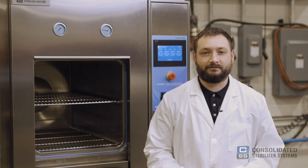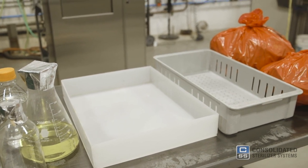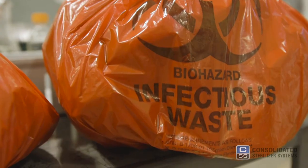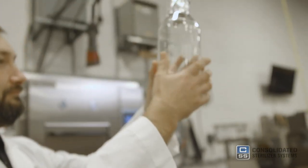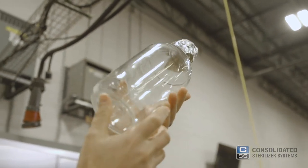In order to prevent damage to the autoclave, it's important that you only load autoclave-safe containers. These include glassware, plastic autoclavable tubs or bins, metal autoclavable tubs or bins, and autoclavable waste bags, also known as red bags. As a rule of thumb, always inspect containers prior to loading to ensure that they are autoclave safe and, if they're glass, they don't have any cracks.